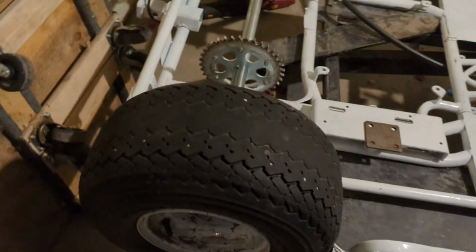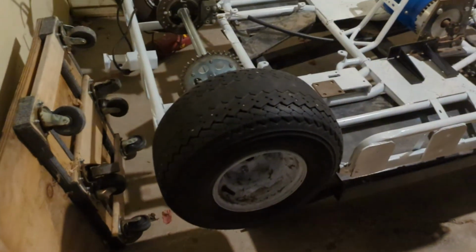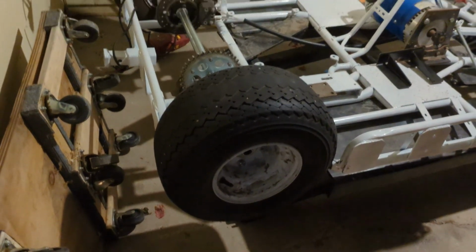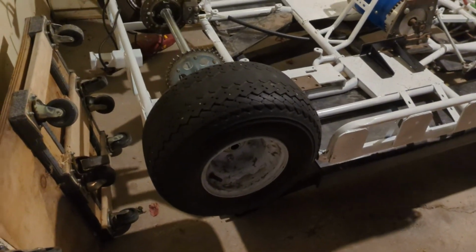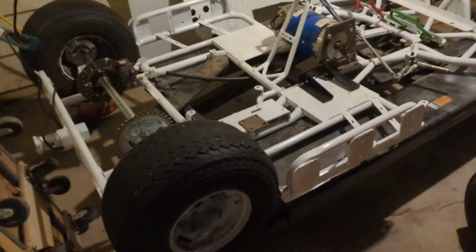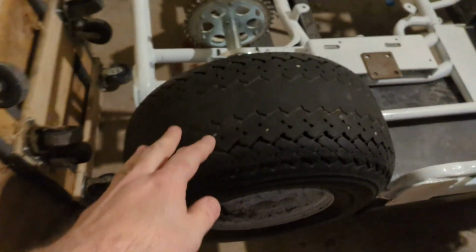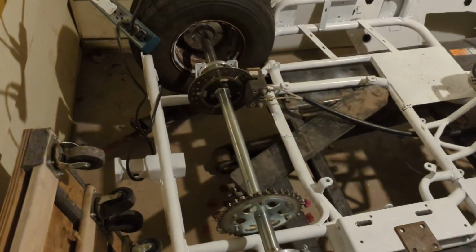So as I was saying, I'm a little concerned about the, I didn't even bother to figure out the percentage, but it's what, 50% going from 12 to 18 diameter. It's a lot more demand for torque. So my vain hope is that these things are so much lower grip than go-kart tires that it will sort of make up for it.